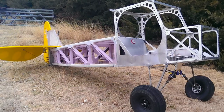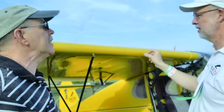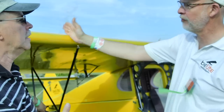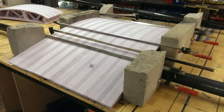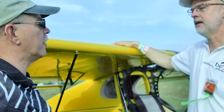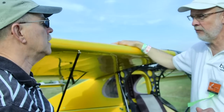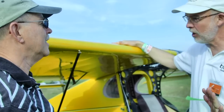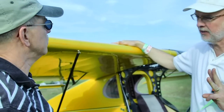The structure is two-inch pieces of foam with aluminum ribs sandwiched in — five foam pieces followed by an aluminum rib — all the way up to the tip. There is no weight savings by going to foam, and no weight loss either, but the real benefit is in build time, appearance, and aerodynamics.